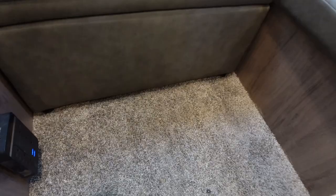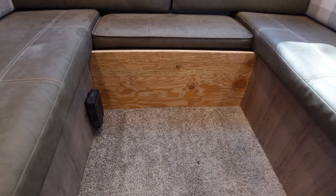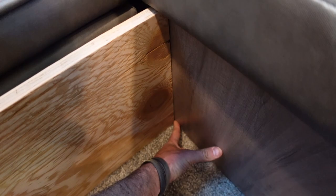I'm just going to measure the width and the height, cut some three-quarter inch plywood, get it stained and get that all tacked into place — just like that, movie magic. Got my piece of wood cut. Fits in there perfectly. I just have to leave enough gap so I can get this thing out — don't want it too tight. Just a little tiny gap there and then the plan is to screw it in from underneath the bench. I know on the top and at the bottom of the bench there are studs so that should firmly mount there.